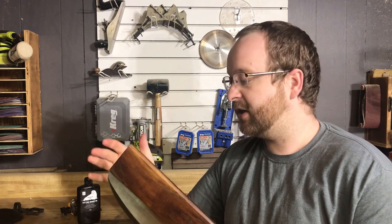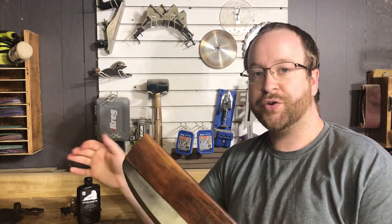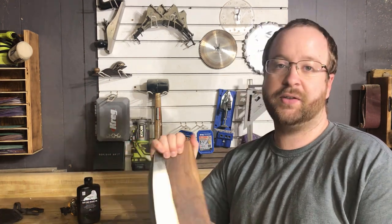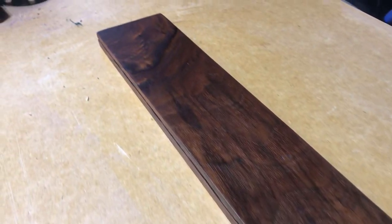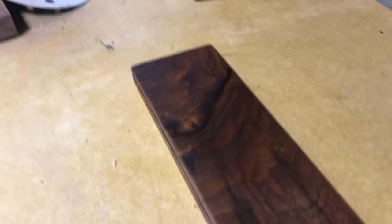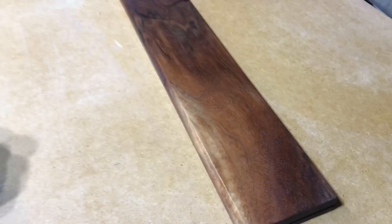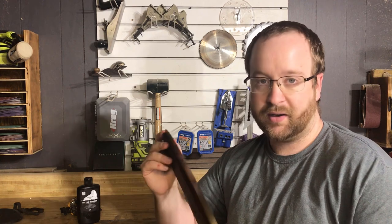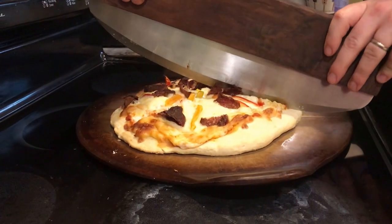We're all finished up now. Taking the tape off did take most of the walrus oil off, so I did have to apply that again. If I was to do this again — and I think I'm going to, because I want one of these for myself — I would do the epoxy first, then do the walrus oil or whatever finishing you're using, after the fact. Epoxy first, get that all cleaned up, then finish. Something I learned going through this process.